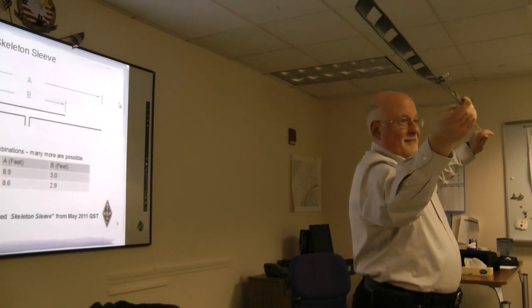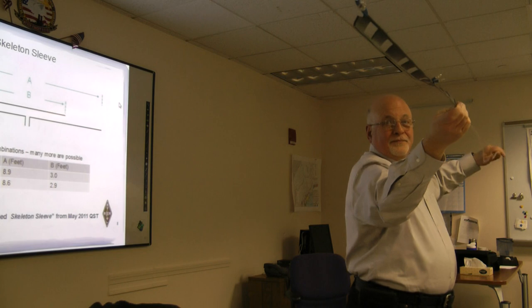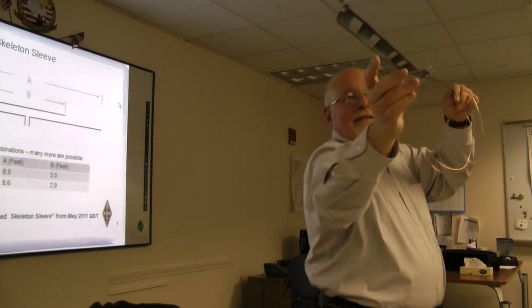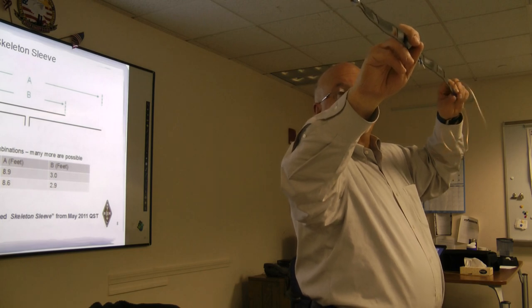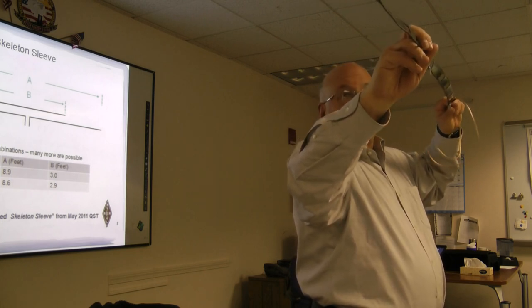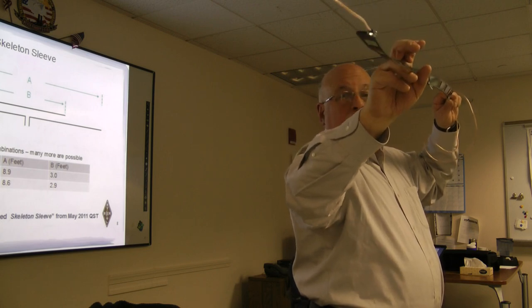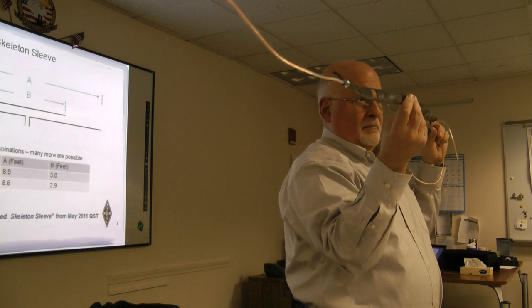And we did everything. I tried two different systems for coupling the wires together. The easiest and cheapest are the crimp ring connectors. And if you have a soldering iron and can back up the crimping with the soldering, I highly recommend it.